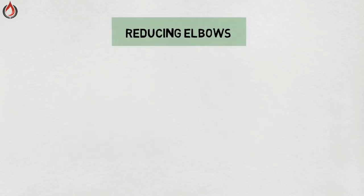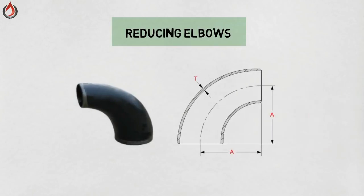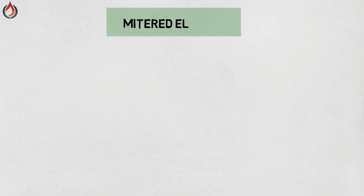Reducing elbow. A reducing elbow is a kind of elbow fitting that provides a change in material flow and joins two pieces of pipe or tube of different sizes. It helps the system avoid pressure losses due to re-acceleration and friction. It has different size openings on each side of the connecting pipes. To choose an appropriate reducing elbow, one must consider material, size, and angle of formation.